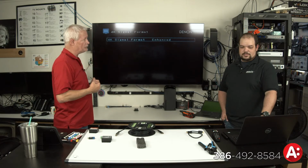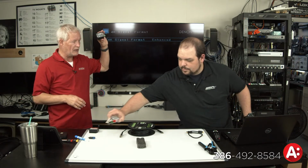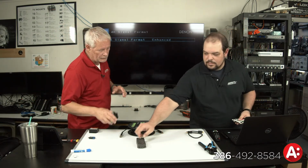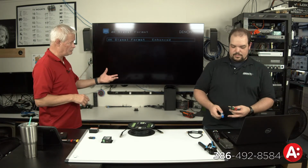So you put a power supply on it, it works for a while, and then it dies. You put a bigger power supply on it, it works for a while, and then it dies. Because it's literally eating itself up with what is effectively a cancer. Use power. Always use power. If you cannot do it with an outboard power supply, do it at the source side with an AIO2. If that's not available to you, some splitters will provide the power down the TMDS feeds.